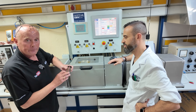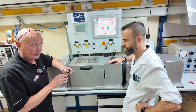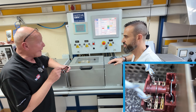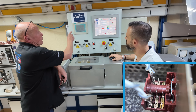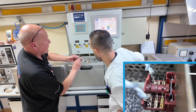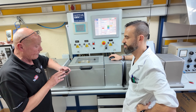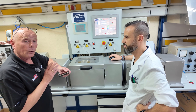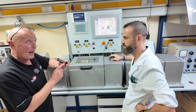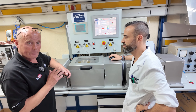The contact switcher not only puts a load on the contacts between 16 amp and 25 amp — it will also rotate the cam exactly the same as the other machine, and it can be set with the amount of load to be put onto the contacts. Now this switch is a 16 amp switch, yes correct. We need to test this switch at a 16 amp load on the contacts, and the first 5,000 cycles will be at 150 degrees, although this casing is made of Bakelite which is capable up to 200 degrees. So we can set the variance for the program for this.